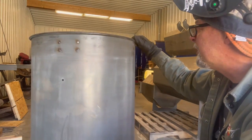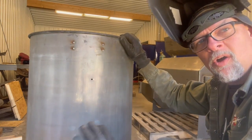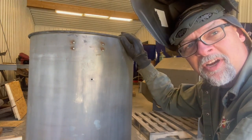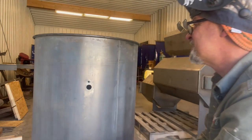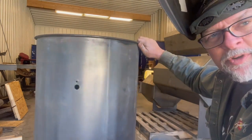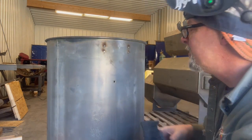What do you think? That looks pretty good to me. We've got the holes left in here for the cooking grates, but all the other holes — I didn't fill in the intake holes because I'm going to cover them up — but all the other holes are welded shut. Now I'm going to take a grinder and just kind of feather edge that down a little bit, just like we were talking about feather edging.